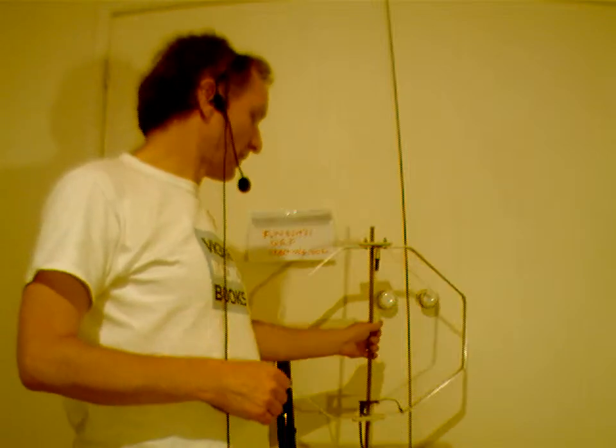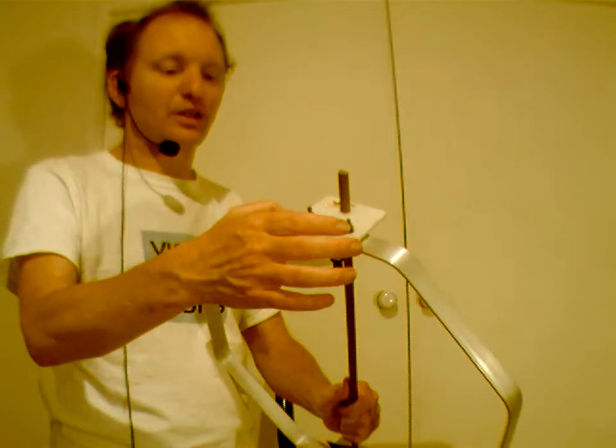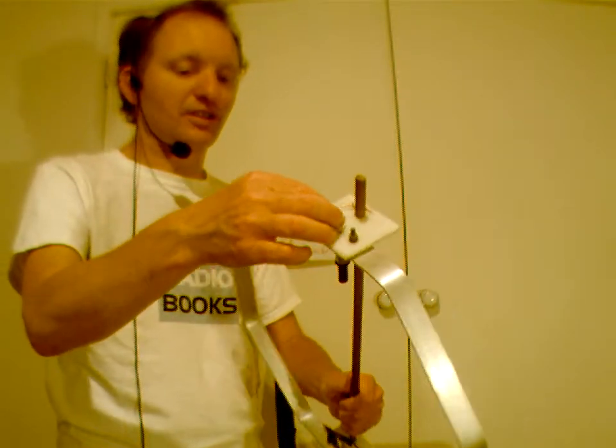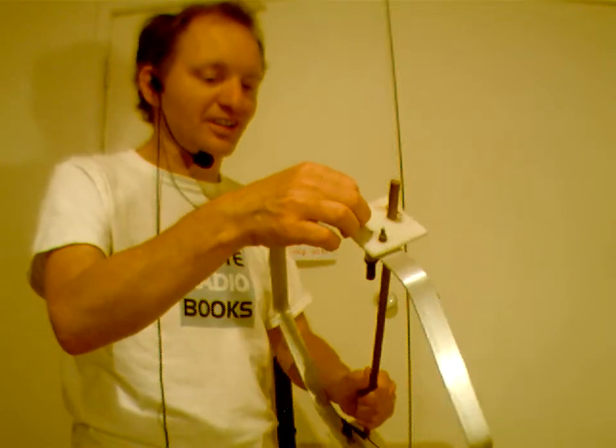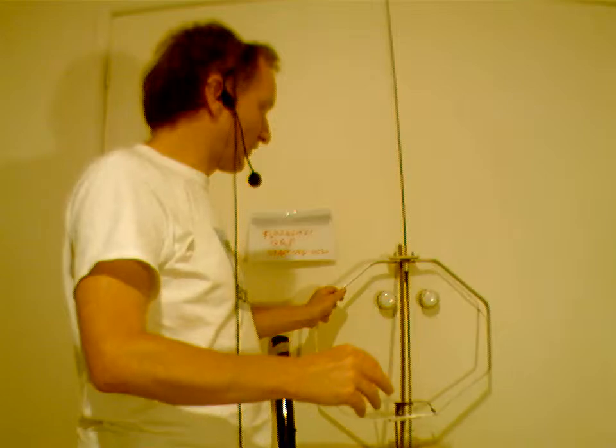It's a very robust material, very easy to work with. And chopping board, quite new, can be fairly expensive, but if you look in second-hand shops, then you can get a few chopping boards, or even steal the one from the kitchen, and use them for various insulators for antennas. Good for dipole centers as well.